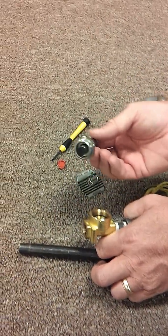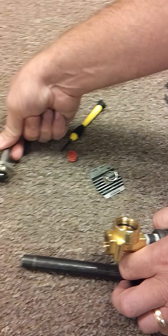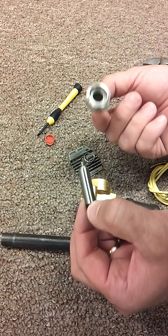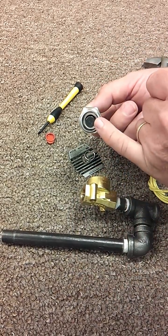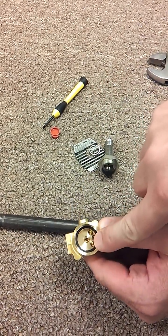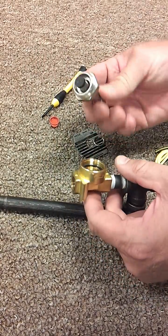It's entirely possible, if we send you another solenoid to replace, that you can just change this entire piece out with one from a new one. If you'd like to, you can just replace this part, but you've got either option. This is the seal that eventually swells a little bit or maybe wears out. There's also an O-ring right here that you could change out. If we send you an entire replacement solenoid, you've got all those pieces.